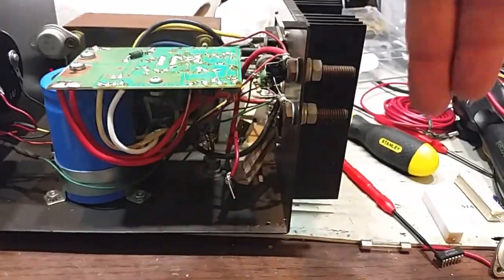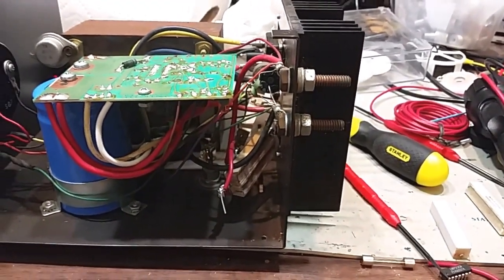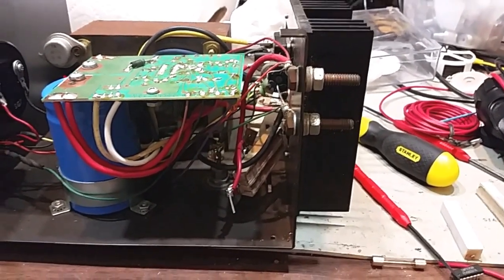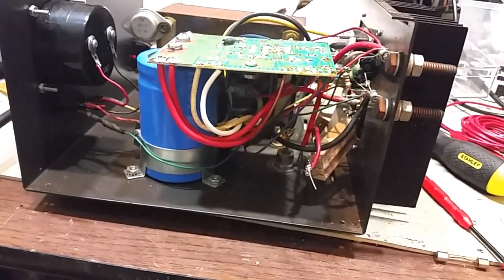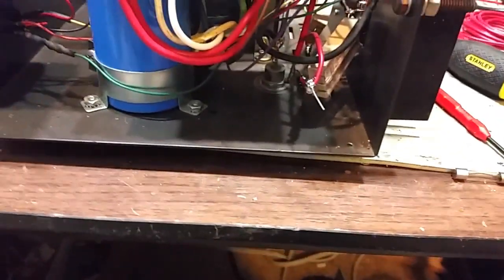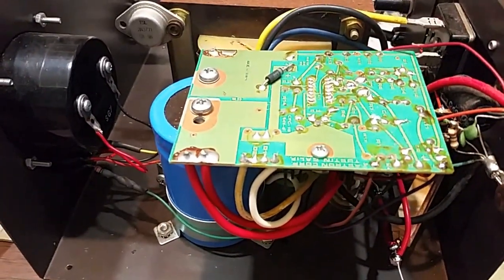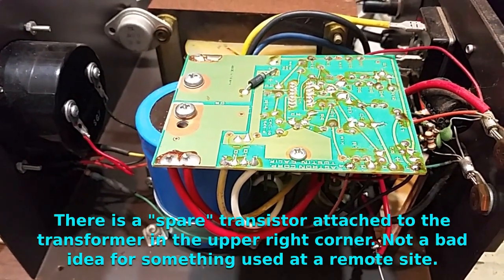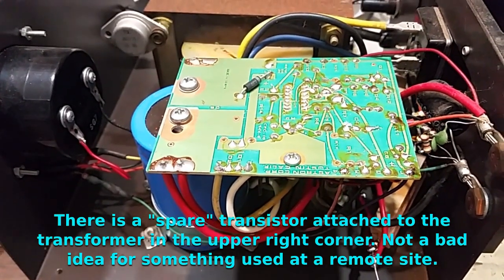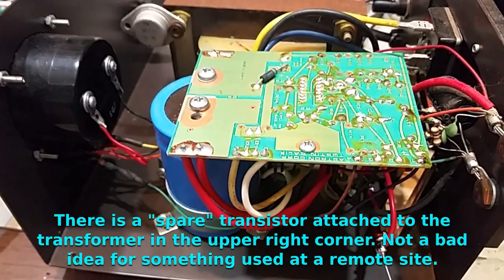When I pulled this purple wire, that stopped it from triggering. What I saw was 25 to 30 volts on the output, which obviously would damage equipment designed to operate under 15 volts. At that point I knew the symptoms were caused more by the crowbar than the actual problem. It didn't take too long — the supply uses a 723 regulator IC, and that had failed. I had another one from a scrapped piece of gear, put it in, and everything seems to be working.